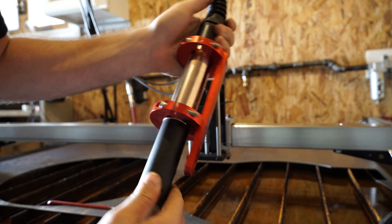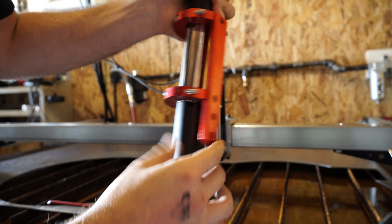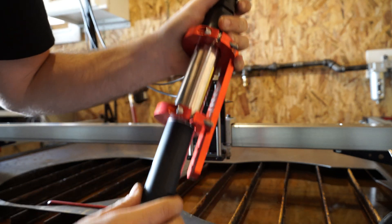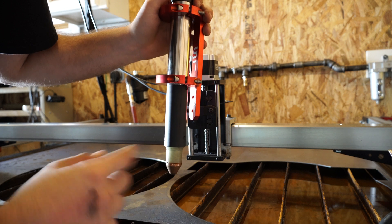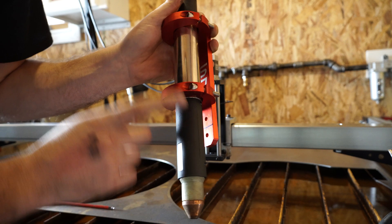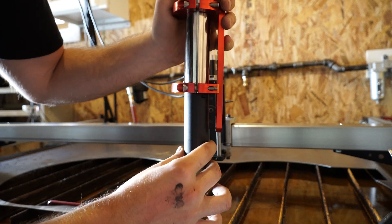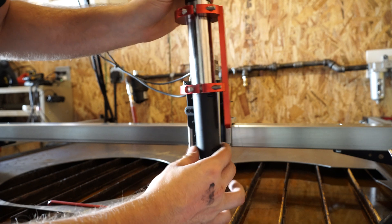I haven't seen any videos on this, that's why I'm making this one. I have it on the first mounting hole right here in the back, and right there I have it marked at the height I usually keep it. One of the benefits this has given me is reducing the bevel on my actual cuts, because this is a thinner profile. So instead of being straight down it was a little angled, but now having it straight down I get nice clean cuts.